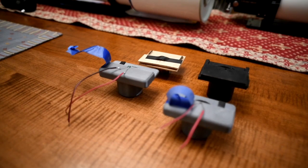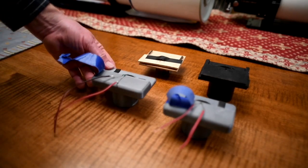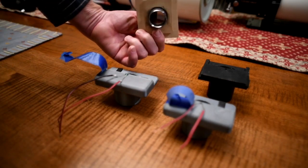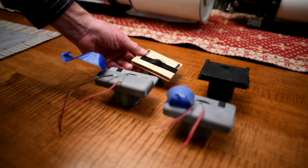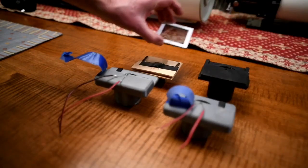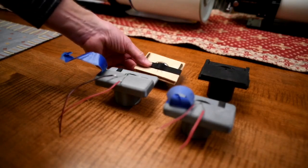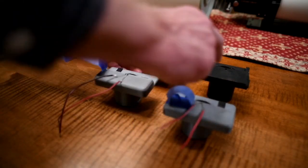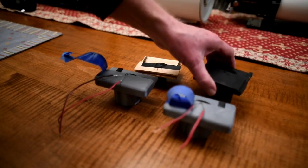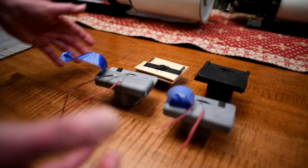And Jeff, as to these Ronchi screen holders, could you please tell us more about those? I see they're in some different materials. Please describe. Sure. With any holder, you can make them out of just about any materials. Here are two homemade ones I made from bits of wood I had sitting around and eyepiece adapters. I very carefully lined everything up, and my Ronchi screens would slide in there, and my LEDs would fit into a small hole, just like you see here. This is 1.25 inches, and this is a 2-inch holder. These were made out of bits of wood I had laying around.